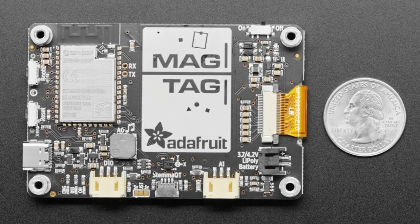We've got an ESP32-S2 module — a Wi-Fi microcontroller. The S2 means it has native USB. We have CircuitPython support, and Arduino support is coming along in a branch, not quite released yet. We have USB-C built in along with a battery and battery charging. Deep sleep is something the ESP32-S2 can do, so you can display something on the E-Ink display, go into deep sleep with almost no power used, and the display keeps the image. That's what's so cool about E-Ink. We're working on a lot of low-power capability in CircuitPython.